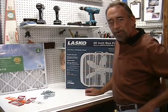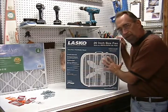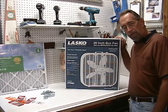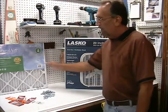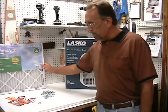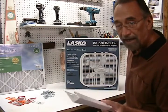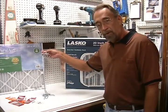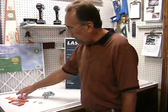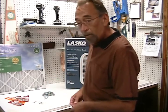To make our cheap trick substitute for a $300 air filter, first thing we're going to need is a fan — just your basic old 20-inch box fan. I picked this up yesterday for $15, usually about $20, but it was on sale. I got a filter to fit the fan, a little better grade than basic, cost me $4.75. And I got some J-channel, available in the vinyl siding section of the store — you'll need about six feet of that. Picked up some chain to hang the fan from the ceiling, plus eye bolts and miscellaneous hardware to attach the chain to the fan. And we're ready to go.